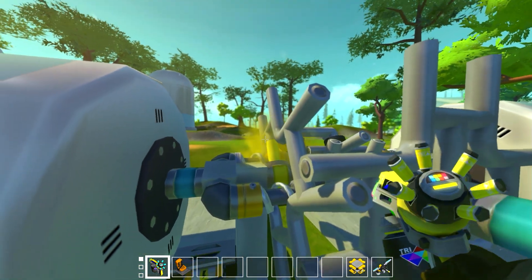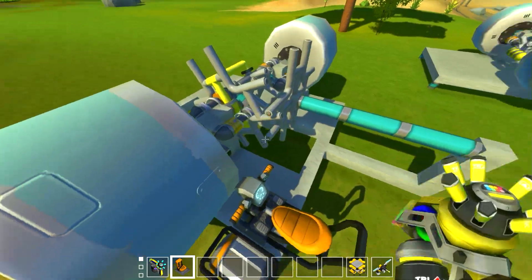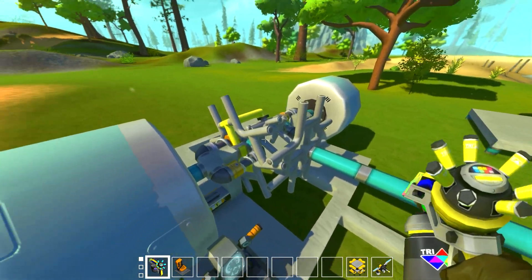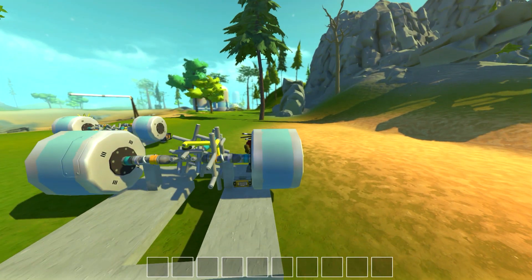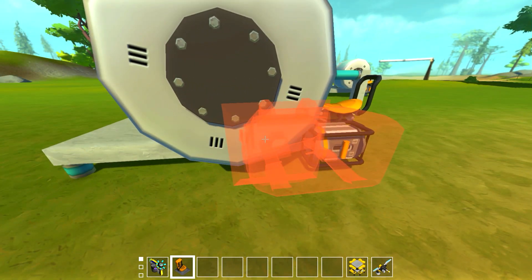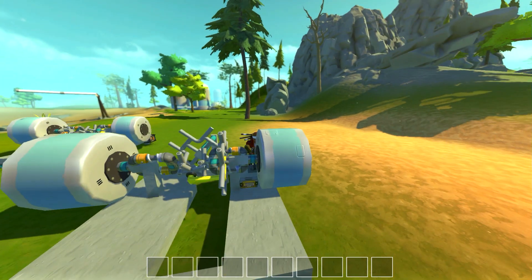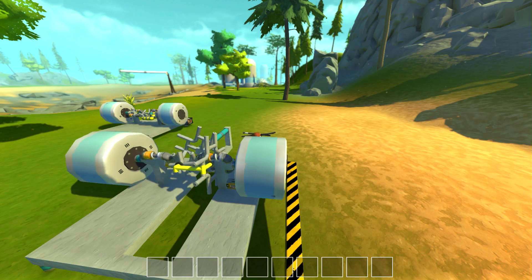We've replaced that yellow bar — if we paint it, that yellow bar would be right here as you can see. It's the same mechanism except this time the bearing is actually powered at the back of the shaft. This shaft will spin, which spins this gear, which engages this gear here. There are two gears meshing, and we'll get the same sort of effect. The differential will continue to work — you can see there it's spinning the wheel in one direction and not the other, and if we reverse it, it'll spin back around.